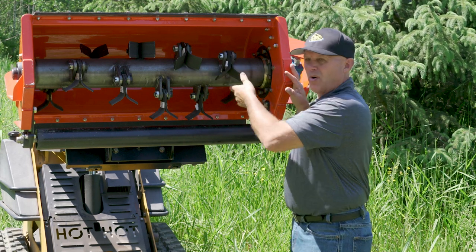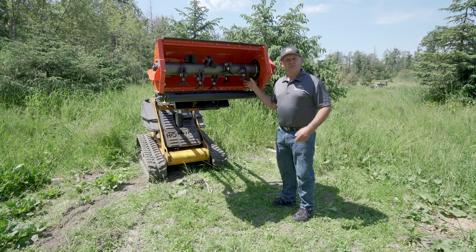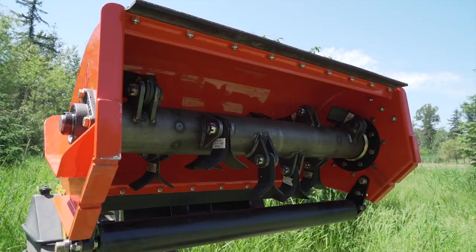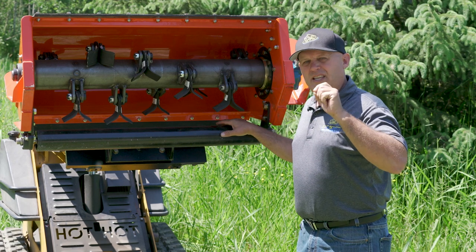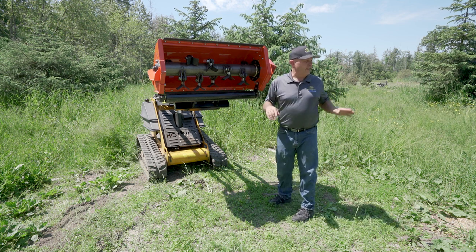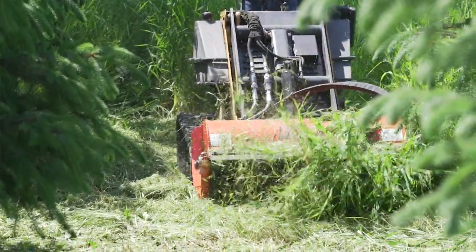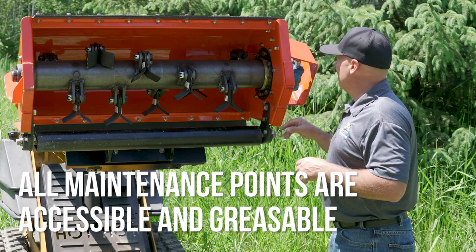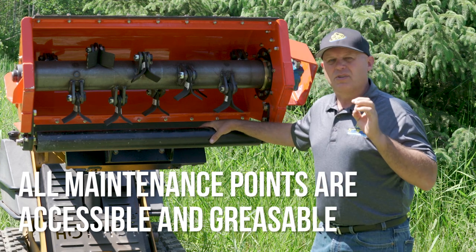The blades are reversible — all you do is undo the bolts, flip them over, and you can run them the other direction. You can get many hundreds of hours out of these blades without ever having to replace them. The type of blades used are very common, so you can find them on a Saturday at any of your local supply houses. Last but not least, it features a heavy 3-inch roller. This roller allows you to set a height and maintain it, so no matter how bumpy the terrain is, you'll keep the mower going at a nice even cut. This roller is adjustable, and all of the main rotating surfaces are greasable — there are grease zerks on the roller, on the drive side, and on the non-drive side bearing. That helps you maintain the mower and keep it at peak performance.